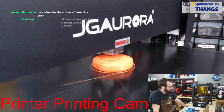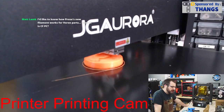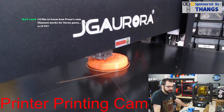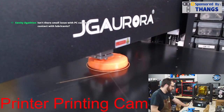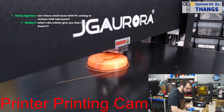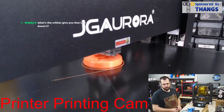Has anyone tried PC? A bunch of people have tried PC. The problem is some PC blends have issues. Some PCs break down if you run them with grease and oil. Grease and oil exposure will cause some PCs to basically delaminate. So you got to be careful with it. I've seen it happen before to a few people's printers. So test it first to make sure you don't have a PC blend that does.